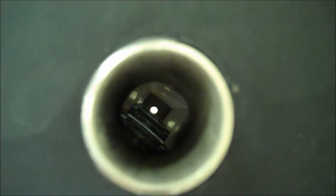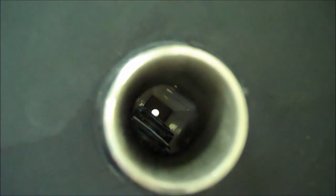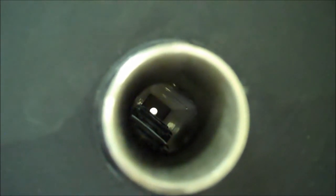There's still enough room so that we're exposing the tube to the most sunlight — this is the ideal look you want to see. If we did not lower that lower support rail, they would be up about another inch, and that's just less tube that we are going to have exposed.